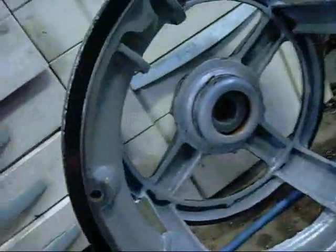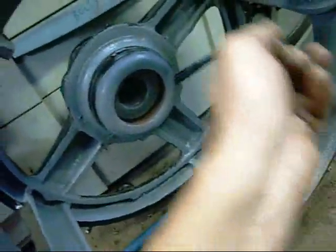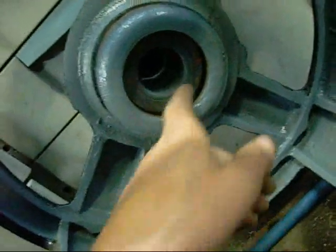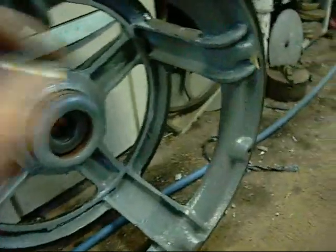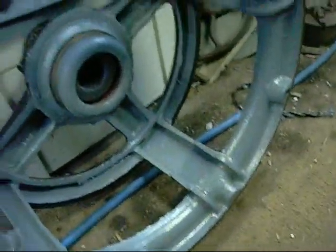This is the end bell for the brush end — the business end. I painted it ages ago. Take all the masking off it. It's got Babbitt bearings — actually, the rear bearing has been replaced with bronze; the front bell bearing is actually cast Babbitt. But it needs a bit of a clean up — scrape all the paint off the mating surfaces and then bolt it together.